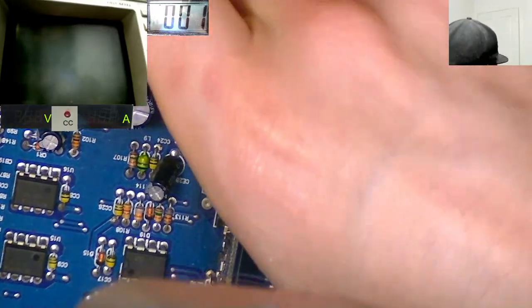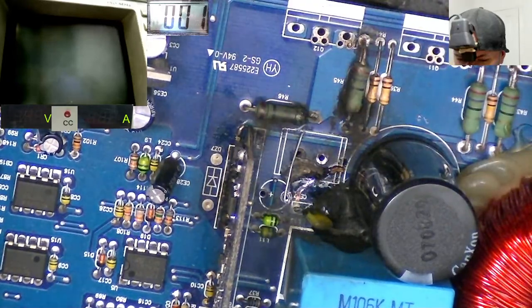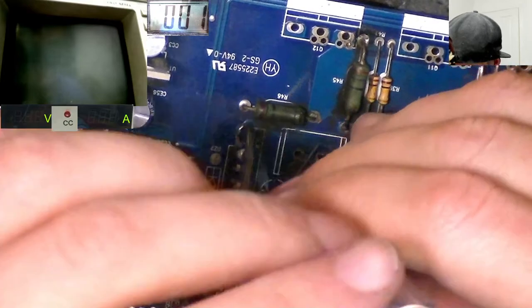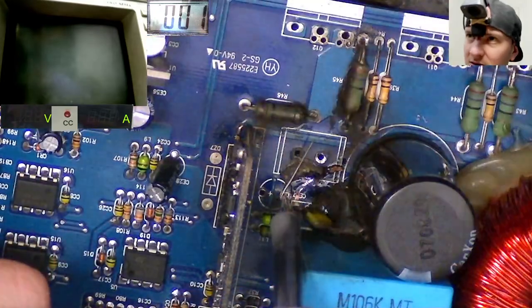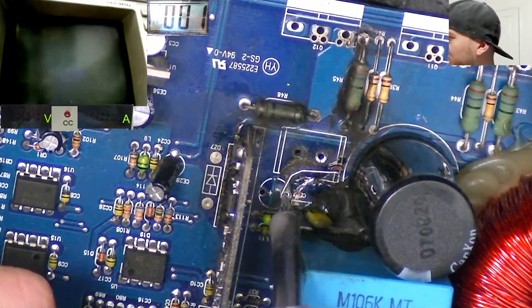So we'll go on like that, I think. Yes, very nice. And then I'm just going to put my little spiky boy in there to hold it steady. And then pull that round under the resistor where the trace would have originally gone. Then we can just solder it to that pad there. Okay, let's grab the iron.